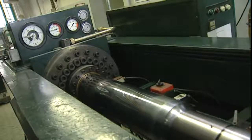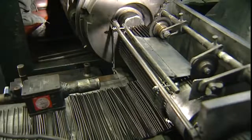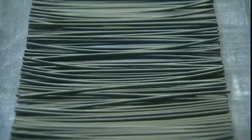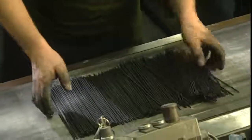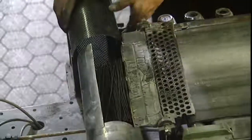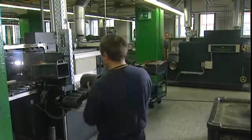The clay graphite paste is extruded through a nozzle under very high pressure — roughly 10 tonnes per square centimetre. The leads are still soft and flexible at this stage, so first they're dried for three and a half hours in an electric oven at 120 degrees Celsius.